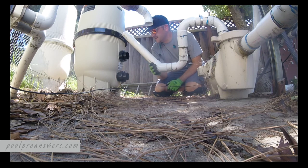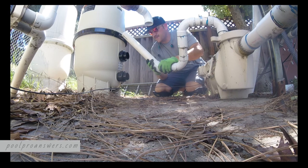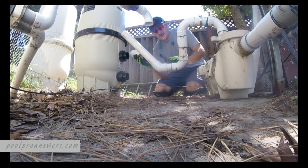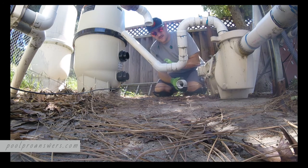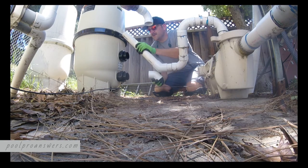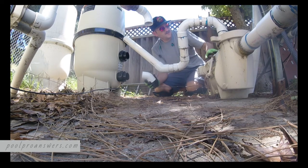All right, so here we're laying out the inlet. You see, I got a 45 on here. I haven't glued anything up. We're always doing a dry fit beforehand. 45s can be a little bit tricky because I've found everything's moving, everything's a dry fit so far. So what's going to happen with this one is once we glue this, see the pipe right now is only about halfway in. Once we glue this, it's going to slide back. Once we glue this one, it's going to slide down. And so that's going to change the location of this one. So what we'll do first is I'm going to leave this a little bit long, just like it is. I'm going to glue this all into place. Should probably fix that too.